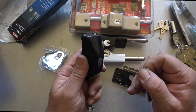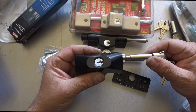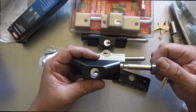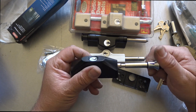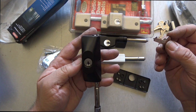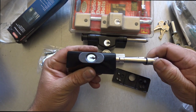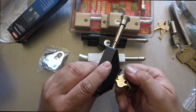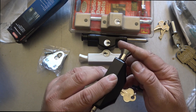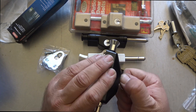Locking and unlocking is 360 degrees. You can also lock the bolt in the open position, which is extremely important for hospitals, childcare, schools — anywhere you need to lock it open. To do that: put the key in, turn 360, plunge the bolt down and it's locked in the open position. You can then key-lock it by pushing the key all the way in to make it double locking.